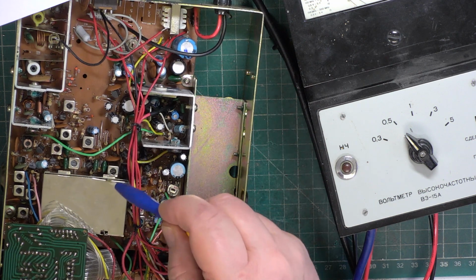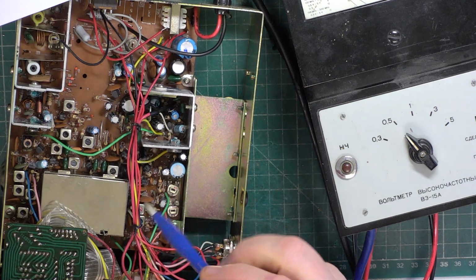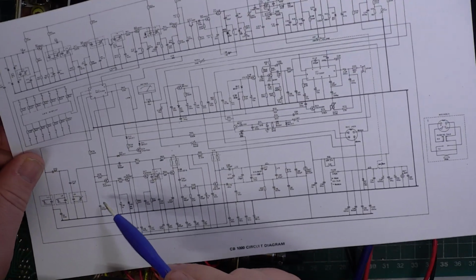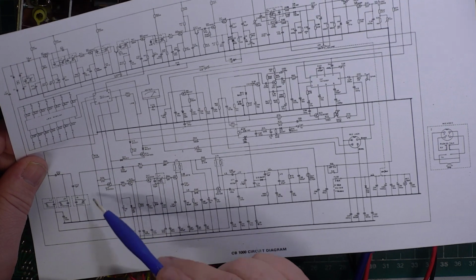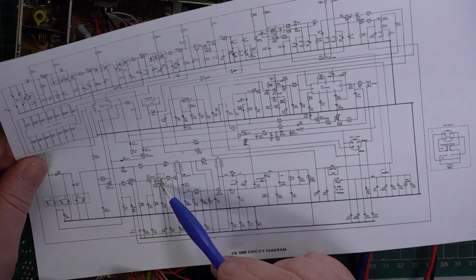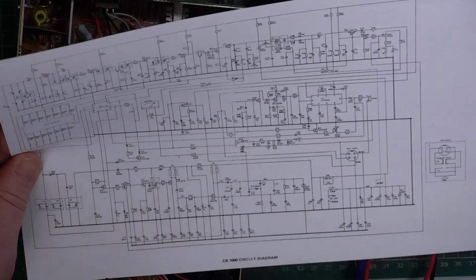That needs, when we've put this together, a bit of soldering up over the microphonic. The tune-up starts on transmit at that coil, then moves on to this circuit diagram which we've dug out, and what I was just doing is looking around L4 and L5 as to where the signal is disappearing. And we seem to have got a problem there.